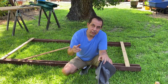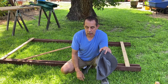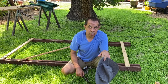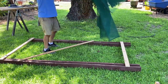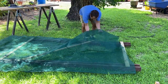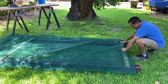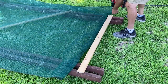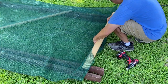The material is six feet so I'm going to have a foot on each side - I can wrap it around, and so it doesn't fray I've got my staple gun ready to go. I'm laying out the cloth - it would be easier with two people but I did it by myself. The wood has sharp corners and the shade cloth has holes, so it's tricky to pull and stretch alone. At the bottom I'm going to unscrew the wood and take it to the workbench to show more detail on how I fold it over the edge so it doesn't fray.